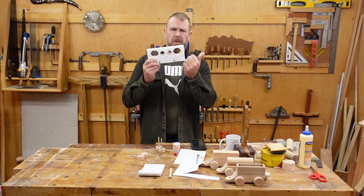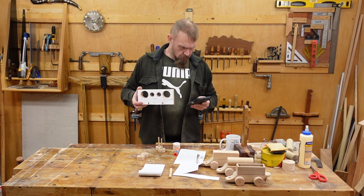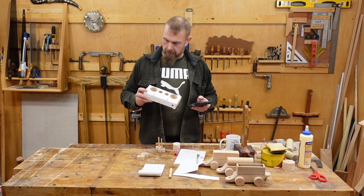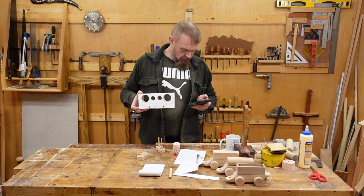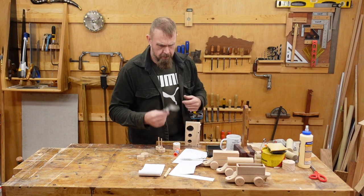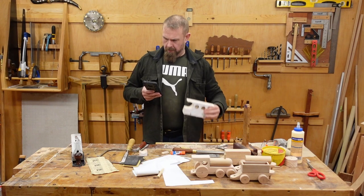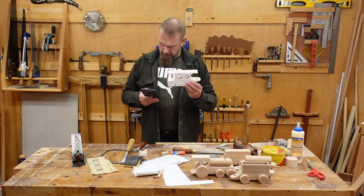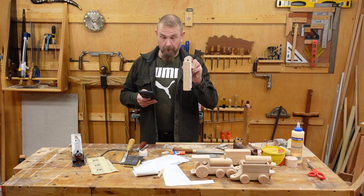I only think I want to move these ones outboard a bit for aesthetics. After the holes are drilled, saw out the rest of the perimeter. Retain the block indicated in red — there's a picture. This block can be used to make the top, or use a scrap of 2x2. I thought I'd make a note about squares and straight edges. Other than aesthetics, that worked out just fine. The tongue around the coupler can be rounded freehand with a coping saw and/or sandpaper — did that and it worked out just fine. Got ahead of myself though — I need to read these instructions.